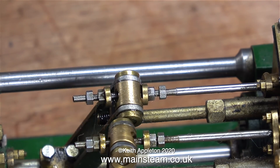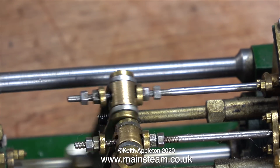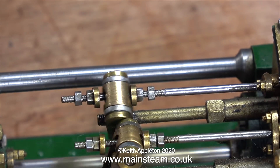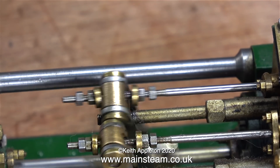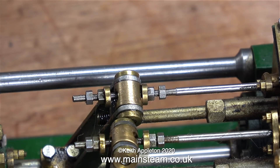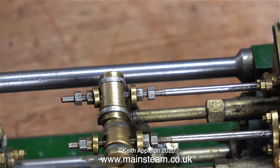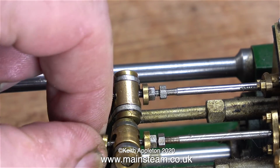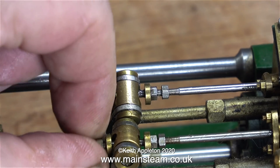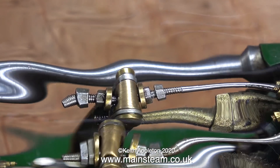One thing that's on the agenda very shortly is to clean this pump thoroughly using a cup of white spirit and a paintbrush to get rid of all the dirt and filth — and what's left of the cat. The pump's starting to sound a little better; it's not skipping as much. But both the steam pistons and the water pistons are hitting the cylinder end caps at both ends. It's worth mentioning that the pump is not working properly anyway because the water chest is in pieces.